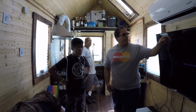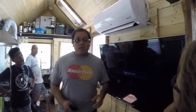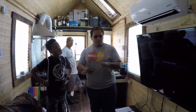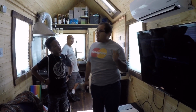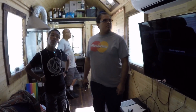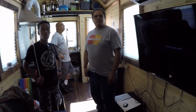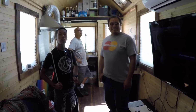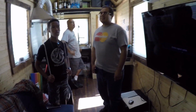I don't get it, but these right here, if you see the thickness, it's not that thick. They will get flooring, tongue and groove panels, and put it all the way around, and that is thick and heavy. The stuff that the plans call for, is this what Tumbleweed calls for? It's for closets, like when you install closets in the house. It's really thin, but the thicker the stuff on the wall is, you lose living space too. If it's an extra inch on either side, that's 2 inches of your living space gone, and it doesn't make any sense.